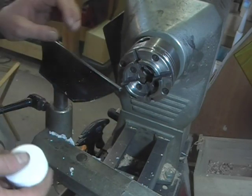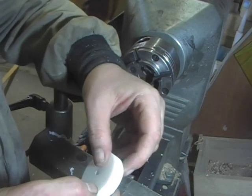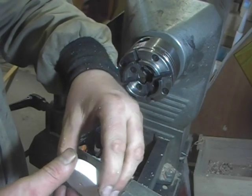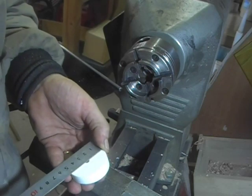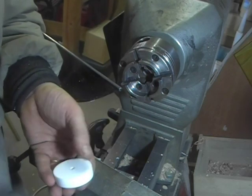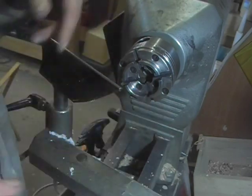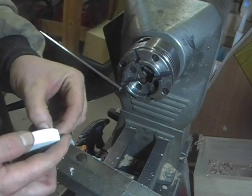I start off with this, which is the inexpensive cutting board stuff. I believe it's about 1/2 inch thick, and this happens to be, I believe it's 55 millimeters in diameter. I happen to have a hole saw. No, it's 50 millimeters in diameter. I have a hole saw that's that size. So I cut these on the drill press. I take a piece of plastic and I cut 5 or 6 of them at one time, so I've always got a few extra blanks sitting around.